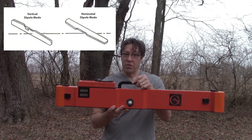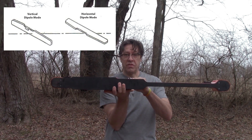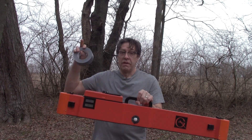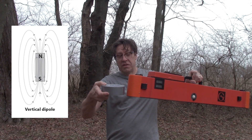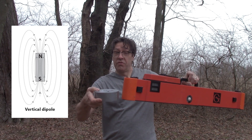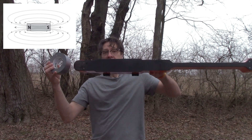The instrument has two modes: vertical mode and horizontal mode. In vertical mode it's oriented upright; in horizontal mode it's oriented flat. The reason they're called vertical and horizontal is because of the orientation of the dipoles within the instrument. The coils look like donuts — all I have is a roll of duct tape, which is useful, though not always as useful as a donut. In vertical mode, the coil is oriented as if it's sitting flat on the ground, and the dipole extends through it vertically. In horizontal mode, the coils are oriented on their side. I'm explaining this because we have to switch the instrument between vertical and horizontal mode during the calibration.